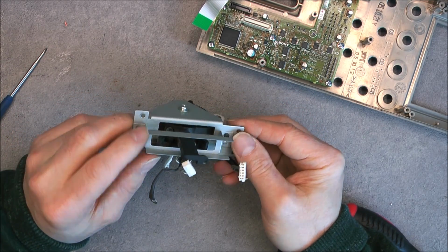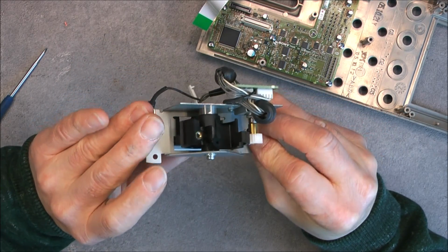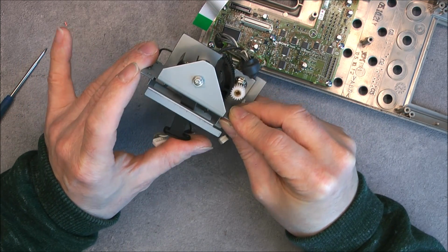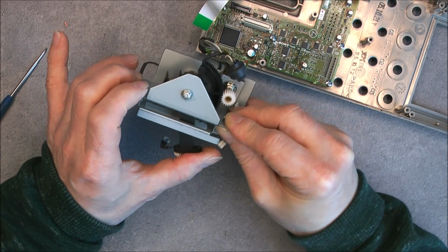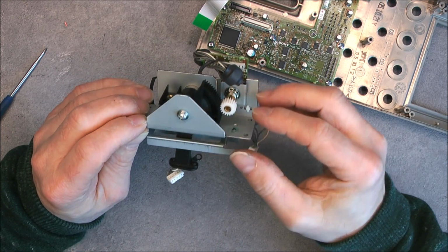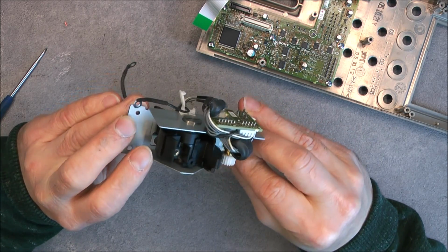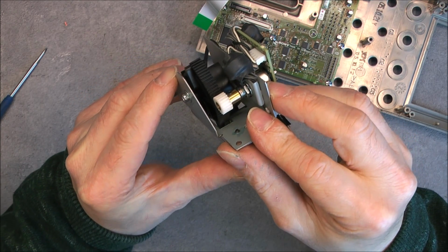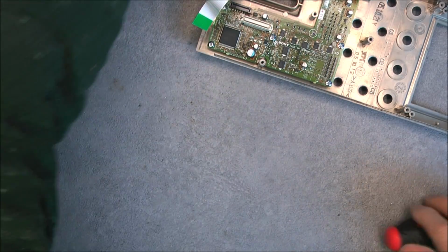Okay. Oh, a nice Allen screw here at the bottom to secure. It is for the main friction level. I believe you can tighten here, then it will be more difficult to turn. You can adjust. Okay. Very nice. Little set screw here. Two of them actually in this brass piece. So beautiful construction.